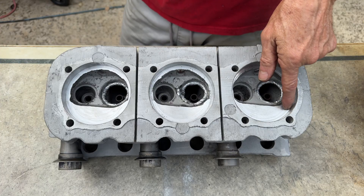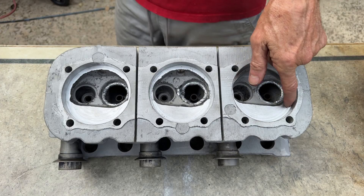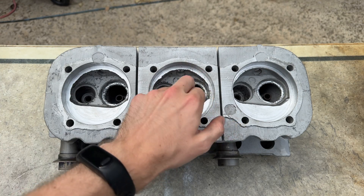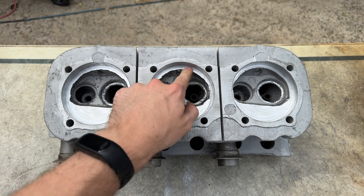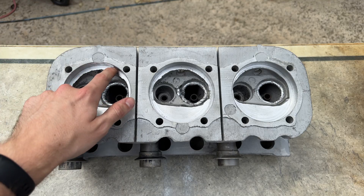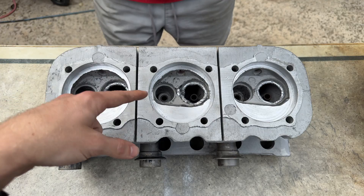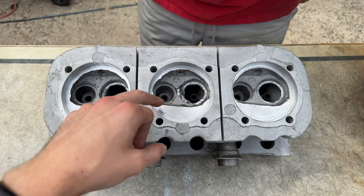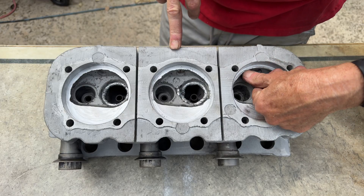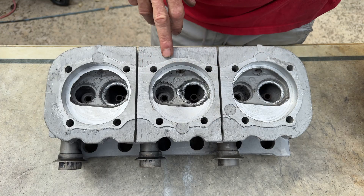It'll come in at an angle and just cut across beautifully. I got one with a very small radius — an eight-thousandths radius. It looks very good. There are a couple of pits up here — there was corrosion on the head gasket surface, that's why he welded up that area. These heads all had corrosion, but now they're very clean. This one still has a little tiny bit, but these are going to be big bore anyway so we'll have minimal problem.